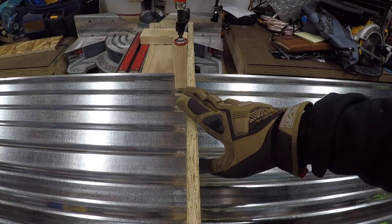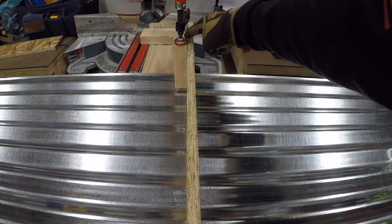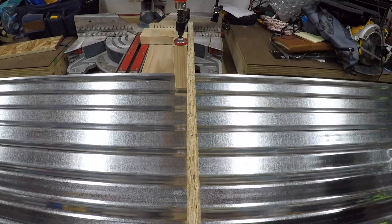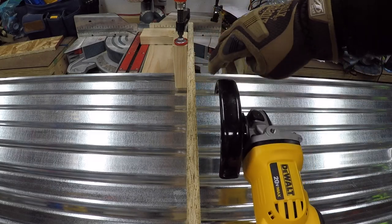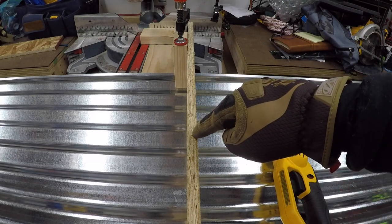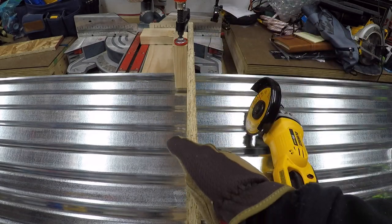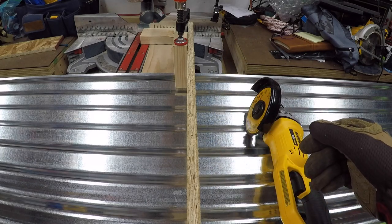Here's the fence I built — I made it out of a piece of pressboard, nice and straight, and screwed in a couple of two-by-fours. I made sure that the screws I put in here are below the surface so when my guard rides up against this fence, they don't hook onto the screws. I've placed this fence at 33 and 3/8 from that end, and when I run this with the offset of the blade and the guard, I should have exactly a 34-inch piece.